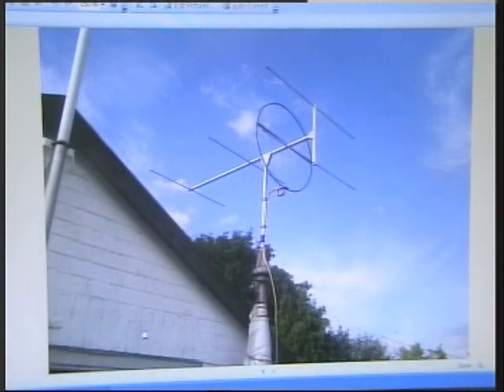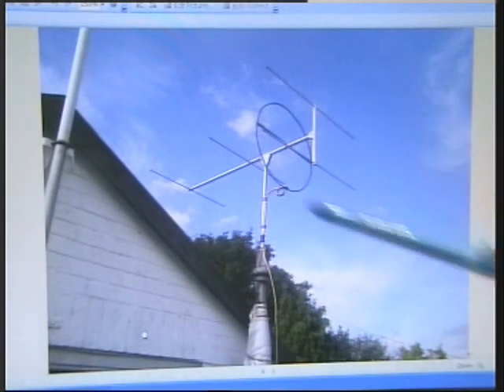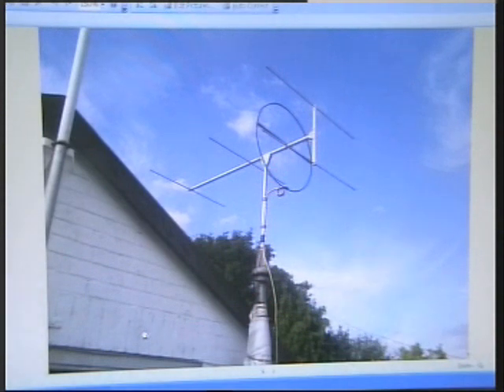The original design I saw in a Practical Wireless magazine in about the mid-90s, I believe. The callsign was G6VNT, so to him goes the credit. But I've modified his design to some extent. It uses a circular round driven element. This type of element probably has the best capture effect of all — better than squares, folded dipoles and so forth. So for a relatively small aerial the gain is quite good.